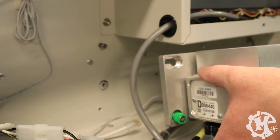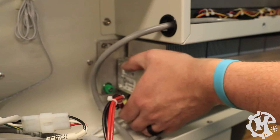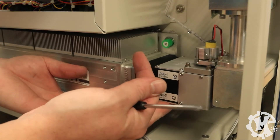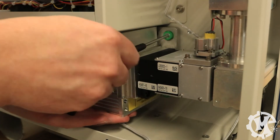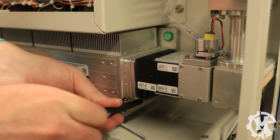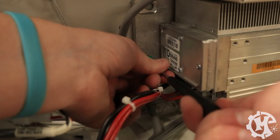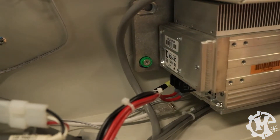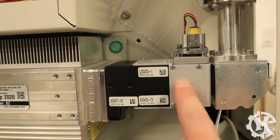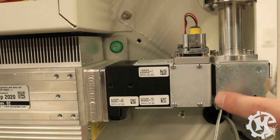The first thing we're going to do is actually slide the tube in. Make sure you go underneath of this gray cable. Make sure you slide the tube over this screw and slide it to the right to put it into position so that we can secure the capture screws. I'm going to start with the capture screws on the right-hand side — I'm going to lift the tube up into place, and then using my Phillips screwdriver, I'm going to secure that screw. I'm also going to secure the bottom one directly underneath it. Over on the left side, you're going to want to secure the bottom capture screw. Make sure they're nice and snug and that the tube isn't going to move. One quick tip: you want to make sure that you can't see through this gap — there should be a black gasket that connects this tube to this mirror assembly. If you can see between that, that's not a good thing. So you need to make sure that the tube is in position all the way to the right to make sure that there's no gap right here.